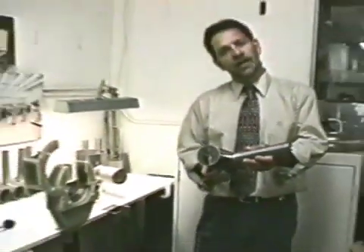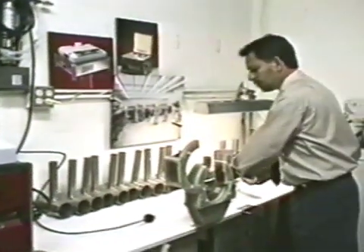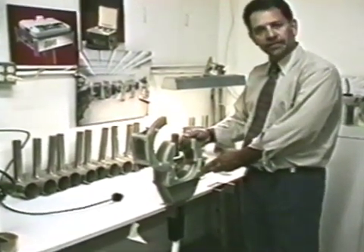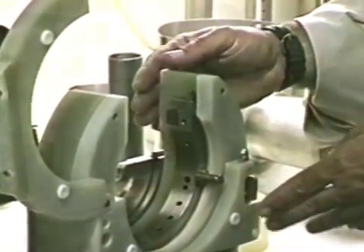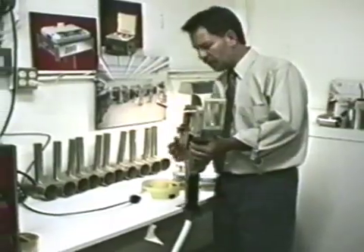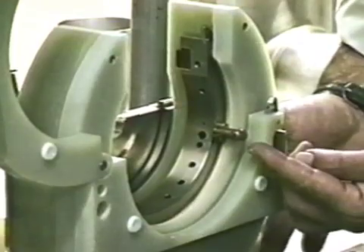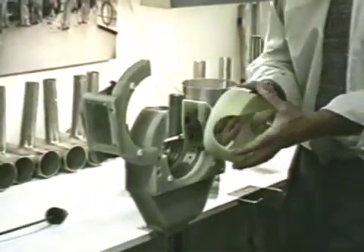The equipment I'll be using for this demonstration is our model 207 power supply, along with our model 9ER 4500 weld head. The welder has been fitted with a wide clamp insert to hold the branch of the weld, an adjustable angle electrode holder which will accommodate different heights of pulls, and a cylindrical gas wheel, which is used to maintain gas coverage around the OD of the weld.